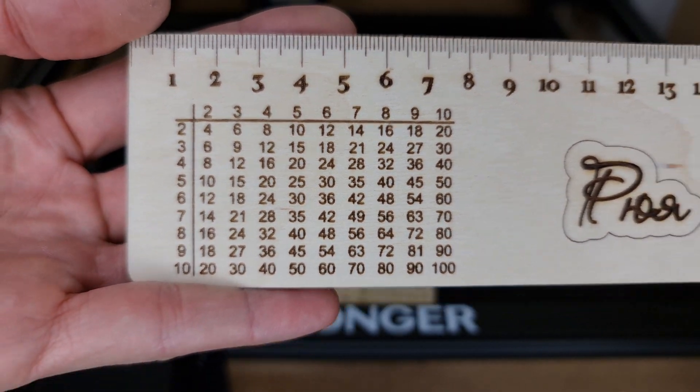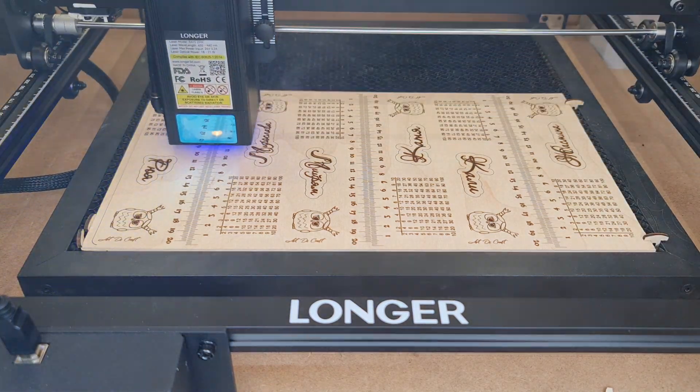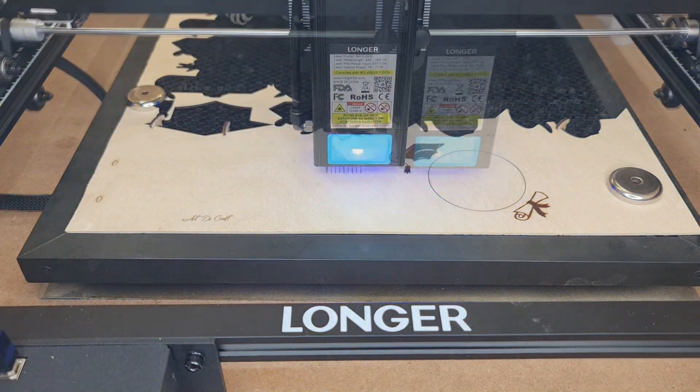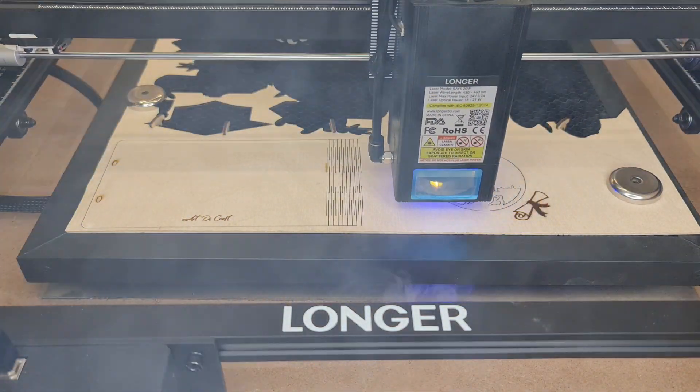This proves that the cooling performance of the laser module is remarkably good. Working in absolute coordinate system also allowed me to do the engraving without air first, then run the engraving and cutting which required air — since the machine currently does not allow you to control air assist automatically. The following day I ran additional projects for other clients, another three hours straight, and everything came out well. This is not a professional machine and won't replace my 80-watt CO2 laser, which would run much faster, but it proves you can tackle some tough jobs without any problems.